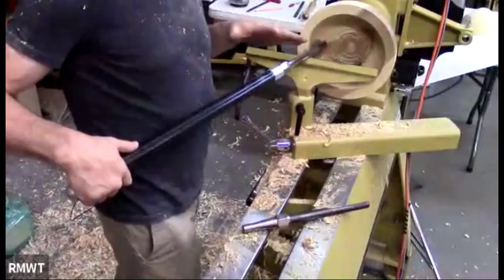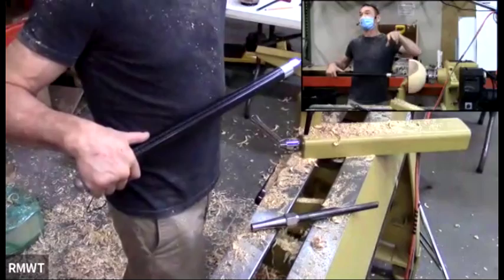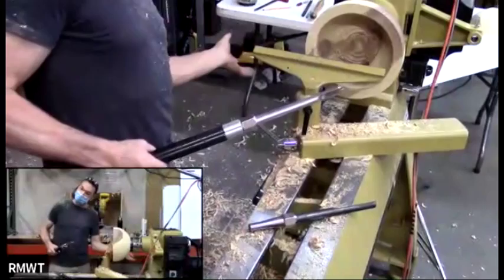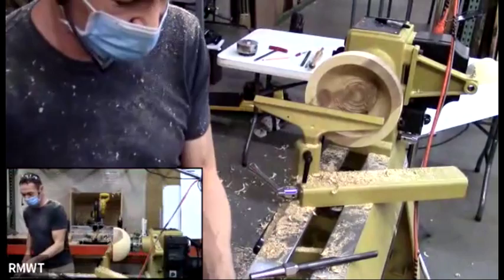Nearly everybody I've ever had, apprentice, professional, in fact, not any student, has got this tool straight away, the bottom bowl gouge. Most students get this after 2 or 3 bowls. They get the idea: point the bevel in, swing around the corner, don't swing too late, you come through the slide, don't swing too early because you make it too thick. But everybody gets this one wrong, the bottom bowl gouge, even though it's an easier technique.